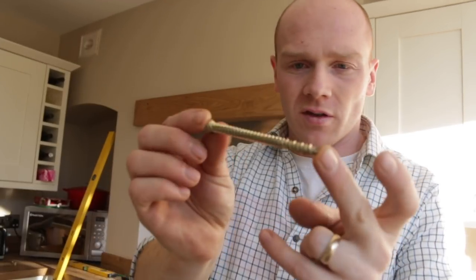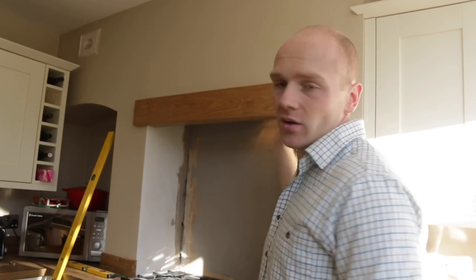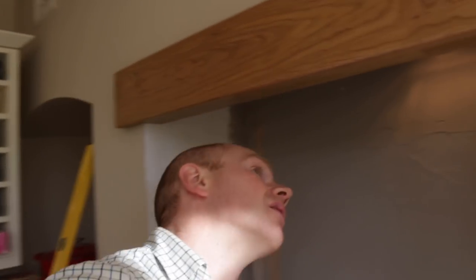Well, we're in. The only thing I'd like to do is see if I can do a hammer fix or something different this end, because I think that concrete screw, which is just these little 8mm ones, all it's gone into is the mortar, and it's lime mortar here, so it's just not biting. It's not going to go anywhere, but it would just pull it in a little bit tighter. What I might do is rub a little bit of that wax on the pine strip, just to seal that from any steam. But you're not going to be able to see under the back there anyway.